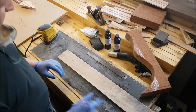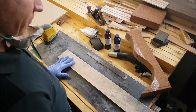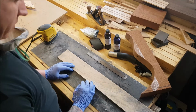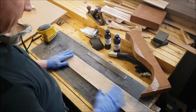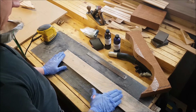That didn't quite work out as I hoped. It didn't stay in the grain. I probably should have sanded it first. There's a lot of tool marks left from the planer thicknesser. So as you can see here, that ripple effect. So what I might do is reapply it. This part is sanded smooth now, and just see if we can bring out that grain a little bit more.